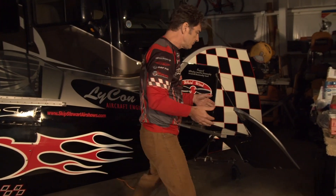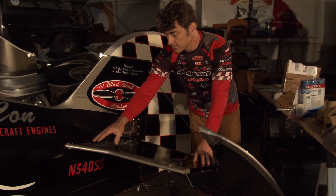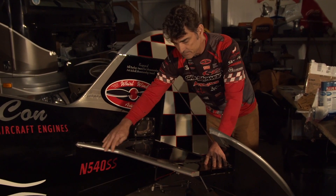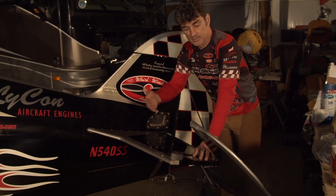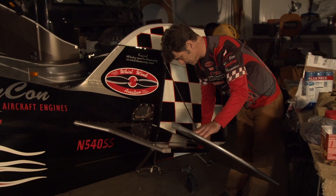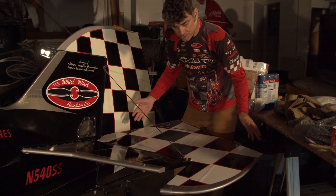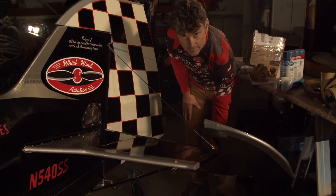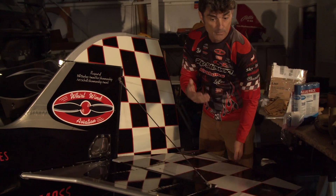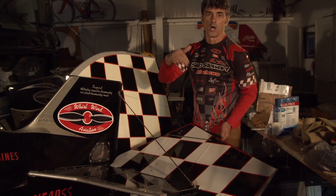The other big difference on this airplane is the tail. Unlike P1, whose horizontal stabilizer is stock Pitts, this one has been reduced almost in half — much less horizontal stabilizer, which makes it less stable, especially when moving the elevator. The elevator is also huge, probably more than twice the size of a stock Pitts. It has 45 degrees of deflection, about 10 or 15 degrees more than a stock Pitts and more than P1. I've adjusted the ratios on P1 so it has a little more down elevator than up, but it's still the same overall throw.